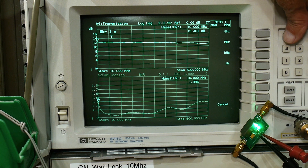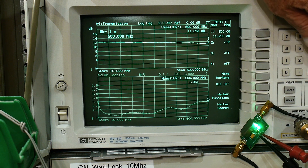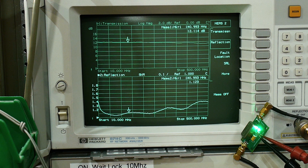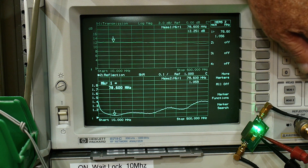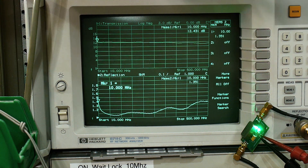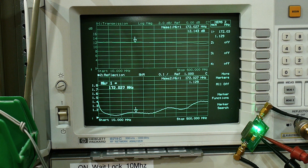We have 12 dB of gain. With a marker, gain goes from about 12.5 dB down to 11.25 dB across the band — very nice. Looking at return loss in SWR: at 500 megahertz we're at 1.3, dipping down to 1.05 in the middle, then spiking up to 1.4. Perfect. It's a useful little amplifier. It's really nice to take a three-dollar scrap off eBay, design a nice little PC board, and turn it into something valuable — just a few bucks for the board and away you go.